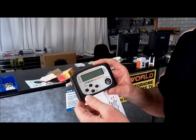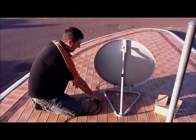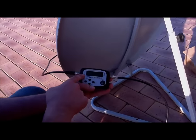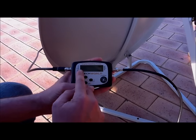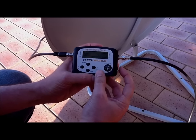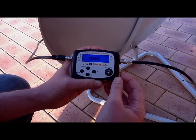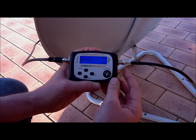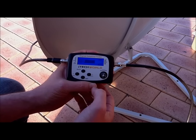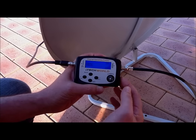We'll go outside now and get one of these going for Optus C1. Let's have a look at the satellite meter — we've plugged it in. This end goes to our satellite receiver and the other end goes to our satellite dish. You'll notice it says zero at the moment, so we're going to adjust the dial on the side. Turn the light on — you can hear the buzzer going. With the attenuation all the way up you can see it only goes to 55%, which means it's on the lowest setting. We want to turn it up to the highest by pressing this button — the next level is 72, that's the highest as you can see.